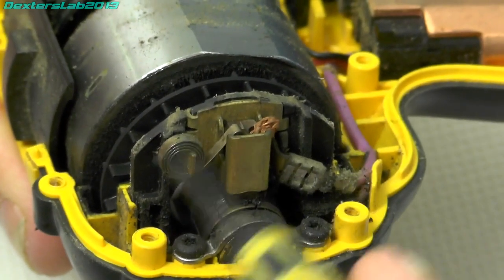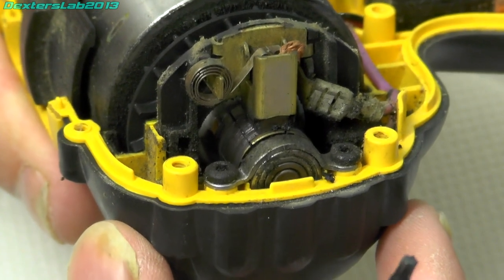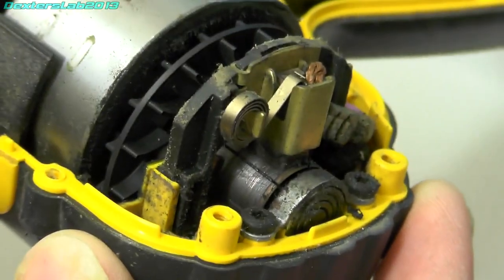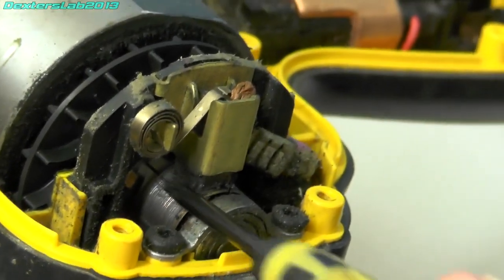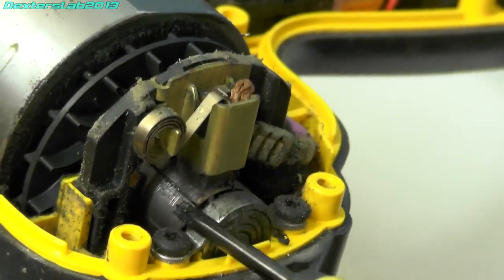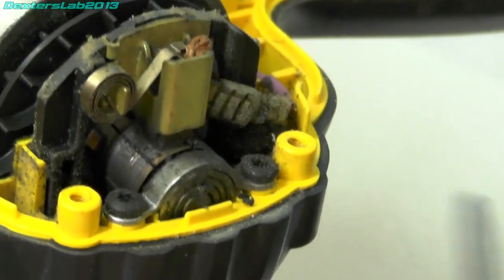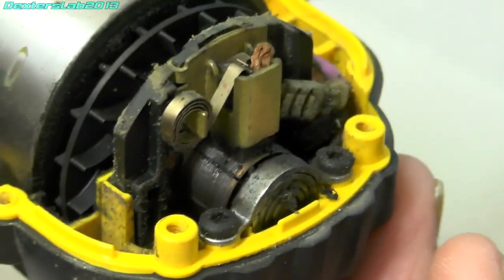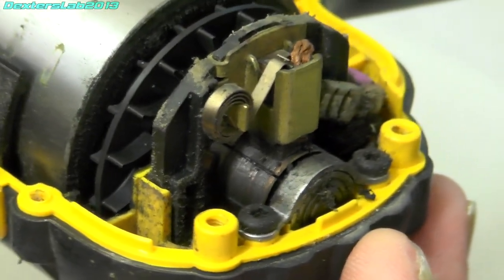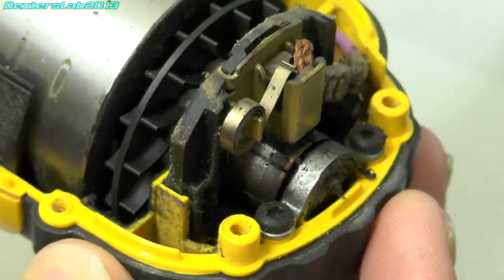So I think what we'll do is remove this part of the motor, give it a good clean up, put it back together and hopefully we can cure this. Usually what happens on these is the brushes and the carbon and graphite all get mixed in and gunged up, and when you put the full power through it creates a huge arc and just burns out the commutator. So it's really not good at all — best to keep this nice and clean. It doesn't need to be oiled or anything; that's what the graphite is for — it basically acts as a lubricant.